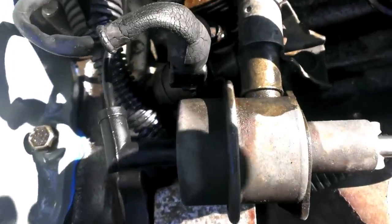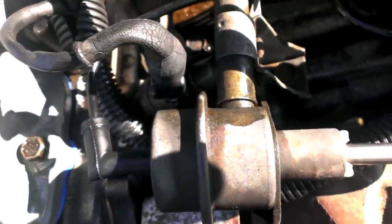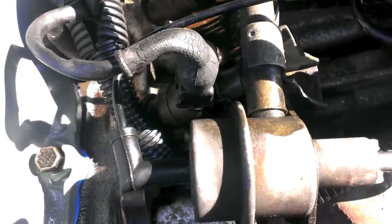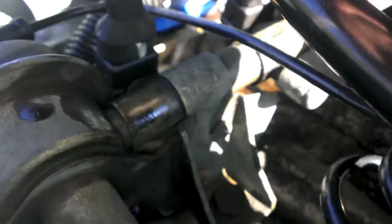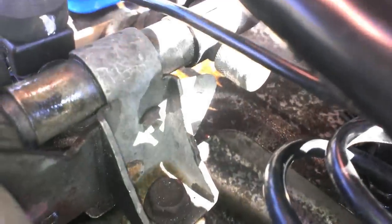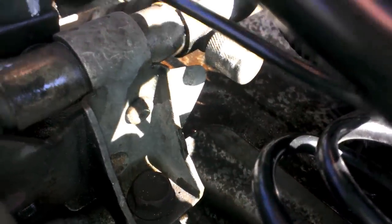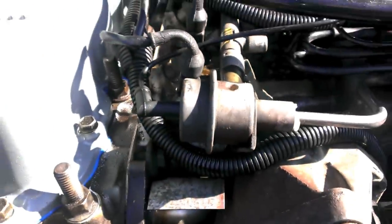From what I've read, there's an o-ring in there that should get replaced. So I guess I gotta take some of this apart to get that o-ring out. It looks like it's held in from this bracket. It's out in the bracket and there's two screws in there and little tiny nuts. So if I can remove that bracket, then I can take this little guy off and check the o-ring.